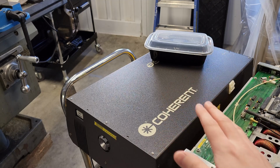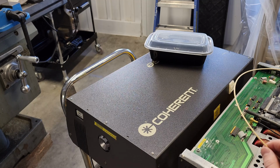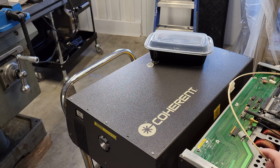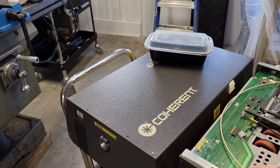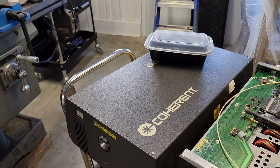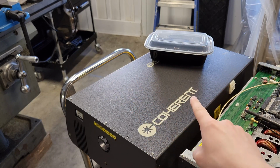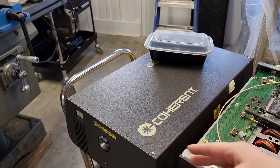But in principle, the 1000 nanometer-ish wavelengths are invisible to the eye. You can't see them at all. This 808, you could maybe see a very faint glow, but it would have to be enormously bright, and it would be extremely dangerous to view this with your unprotected eye. And then you pump the crystal in here with 808 nanometer. That converts to green light with the second harmonic crystal, and then that green light pumps the titanium sapphire crystal and it outputs the actual pulses.